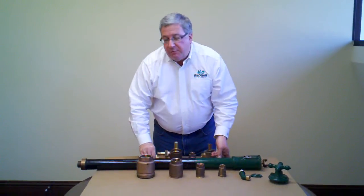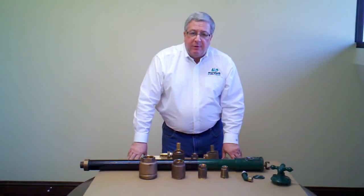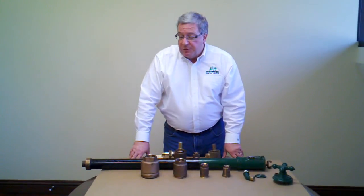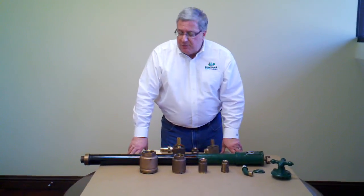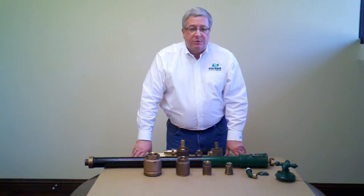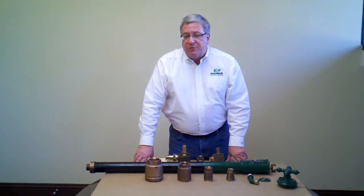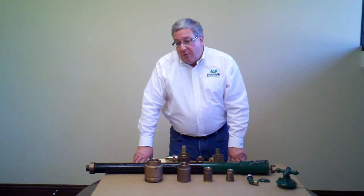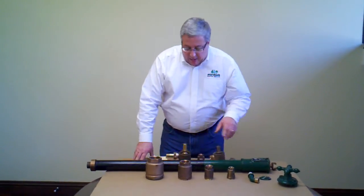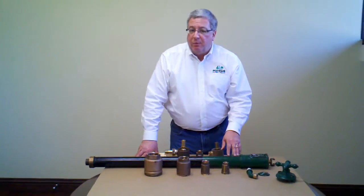The way to tell that you need to replace washers is if the hydrant starts dripping or if you see your water bill jump significantly. This is all preventative maintenance — you need to do it at least yearly. If the hydrant is used a lot, or if it's a wastewater treatment plant using gray water, replace them probably every six months. Same goes for hot water use. We also have neoprene rubber washers as an option if you don't want to use leather.